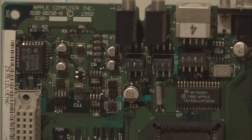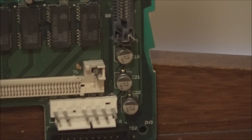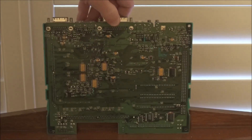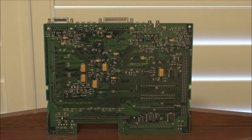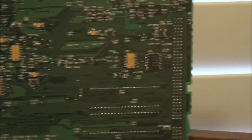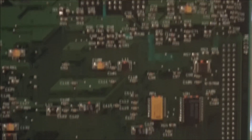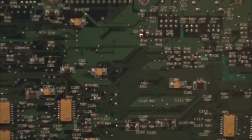This particular LC3 has capacitors which are just starting to fail. In the next video I'll go through the procedure for changing these surface mount capacitors. Flipping the board over, you can see that most components don't have pins going all the way through — some do, like the expansion card slot and the ROM chip sockets — but most don't. There are also surface mount components on the back of the board, but generally the capacitors are only mounted on the top side.